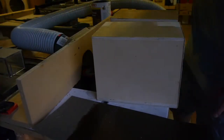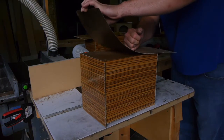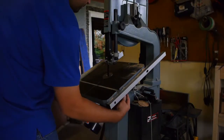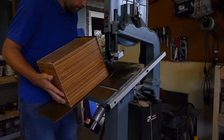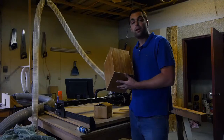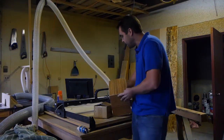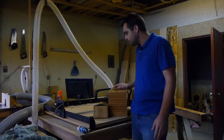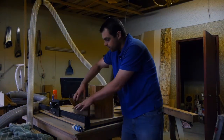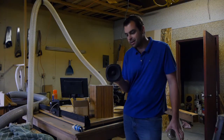I use a roller once I get going. Here go the baffles — I kind of screwed up the baffles, they're a little cockeyed, but thankfully they're mirrored so they're both slanted opposite to each other. The baffle pieces were so long that I trimmed them off using the bandsaw — be very careful with that though, because the laminate can chip and make an absolute mess of your work. At this point the boxes are fully laminated but there are no woofer, tweeter, or terminal holes yet. I have this really crappy CNC machine, but because it's so crappy the box won't fit under the Z-carriage.